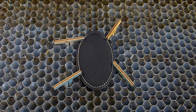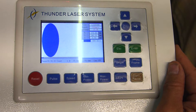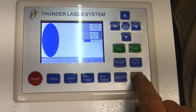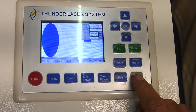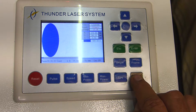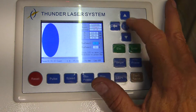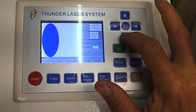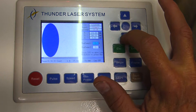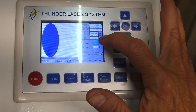We're going to stop it — it's way too hot. So what I'm going to do is drop that down. A little bit too much power. Because we don't have a lot of real estate on this, I want to stop it. So we've hit Pause. Then we're going to go to Max Power and we're going to use our arrow keys to drop this down just a little bit. So now we're at 19.5% power.